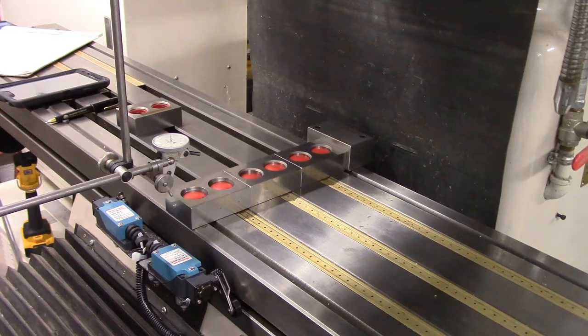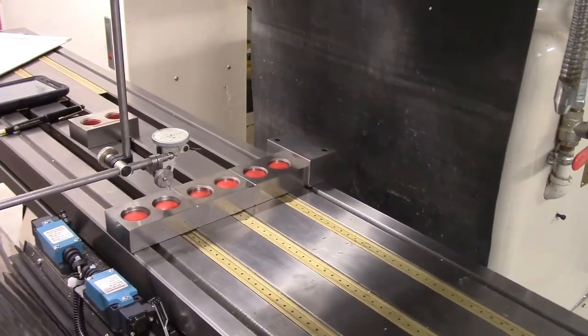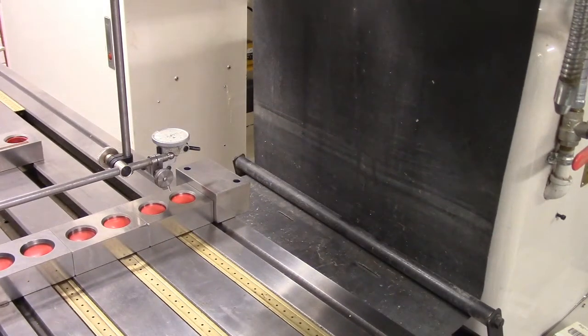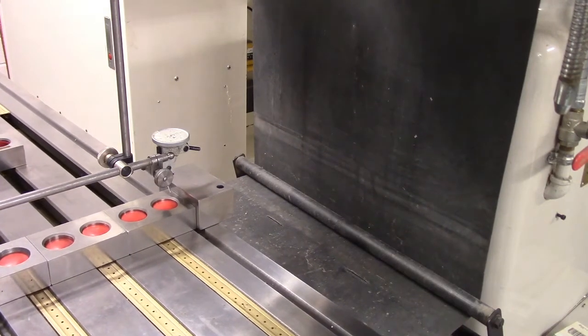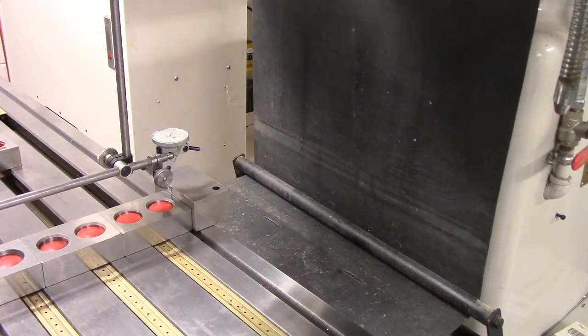Go into the jog panel, Alt-J. Fast jog, bring Z up. Now heading in the positive Y direction until we get close to the block. Go to slow jog, slow jogging until really close. Go into incremental mode — go into tenths. Super close, going to thousandths, then going into tenths.